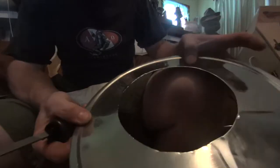And you're going to feel and you'll hear when filing, there's an art to it. And if you're not good with files, I highly recommend you buy an old axe head, old axe if you find somewhere. Go to a yard sale, go to eBay, go to Amazon, find a cheap axe, and spend a few hours with a file in your hands trying to profile an axe blade. You're going to hear how metal reacts. You're going to know the difference of sharpening, deburring, rolling these edges off. You're going to feel the grippiness. And you're just going to get to know how to use a tool. Doesn't mean you're going to become a master at it overnight.